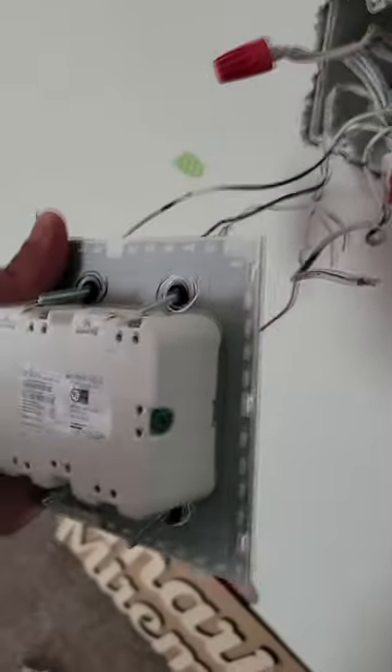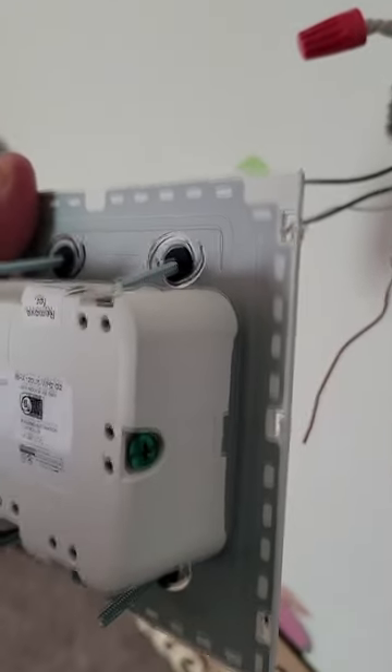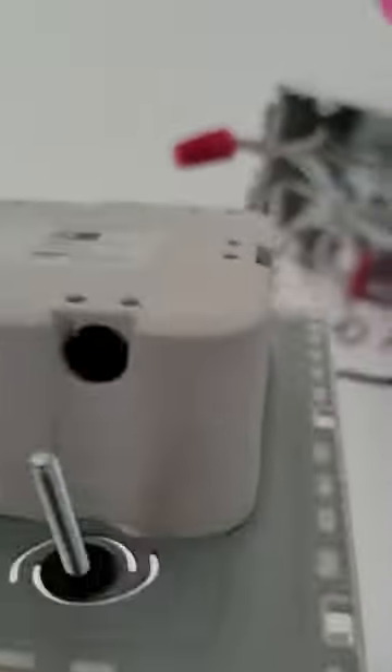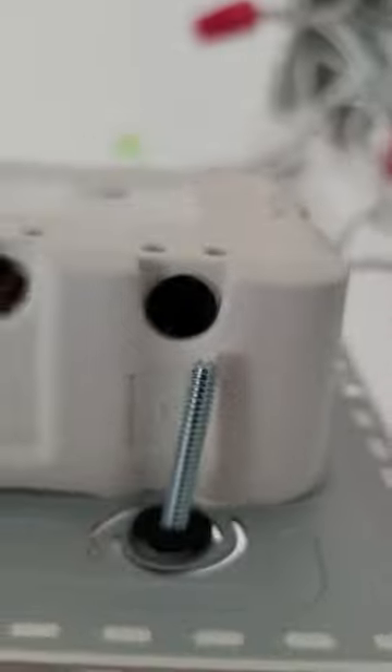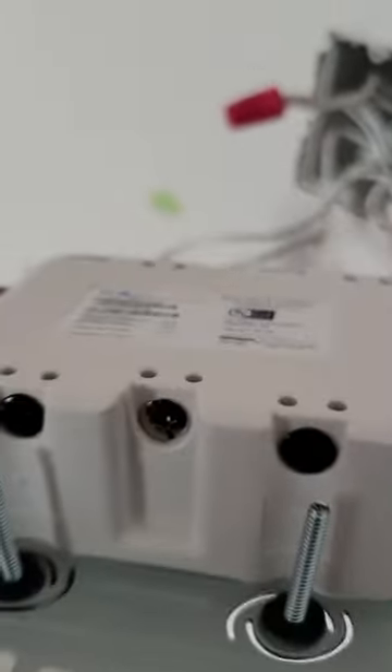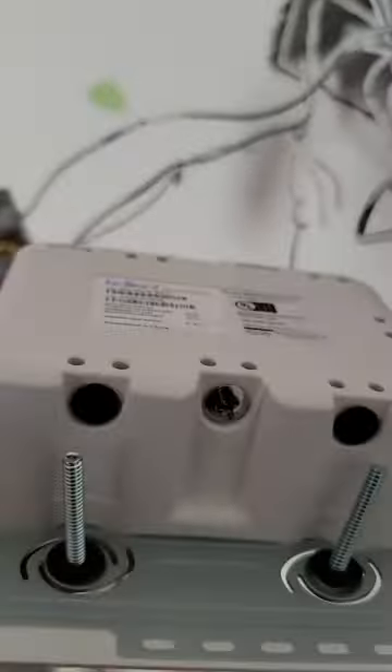So basically what I'll do is flip this around. On the Brilliant Switch, you have a ground wire — you only need one ground. Then at the bottom you'll have your common wire; if you look on there, it's a C. I'm not an electrician, but I've done a bunch of these. And you see the N for neutral — that's your white wire. And you can see another common wire.